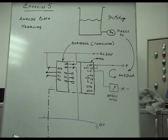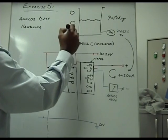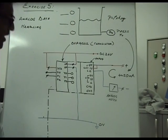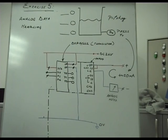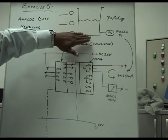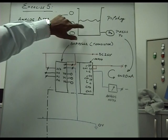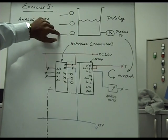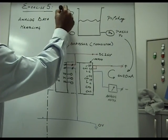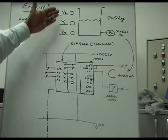There is a possibility to adjust a low level alarm, an intermediate level alarm, and a high level alarm. Each of these can be adjusted by entering a value through the HMI. When we connect our 4 to 20 milliampere signal into the system, you will see the tank level rise and fall depending upon the value of the current signal. The system compares this value with each threshold — if it exceeds, it will trigger Y0, Y1, or Y2 respectively.